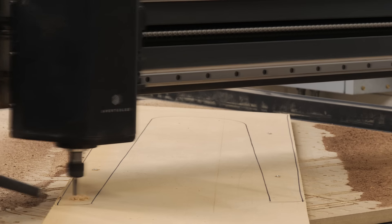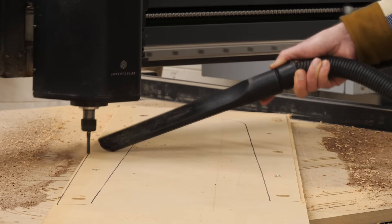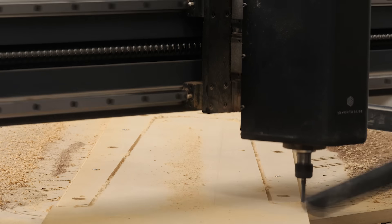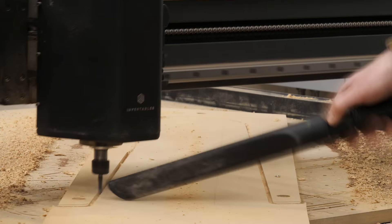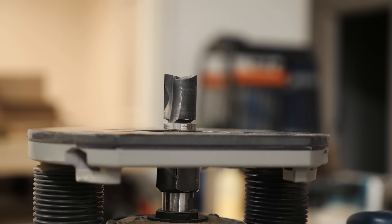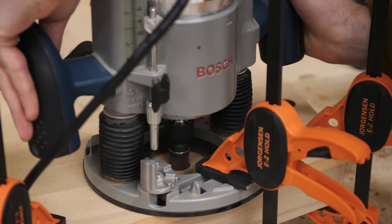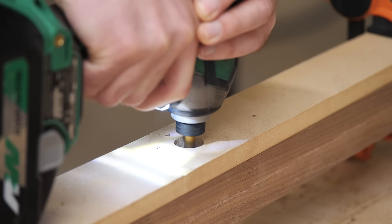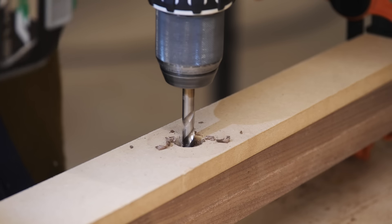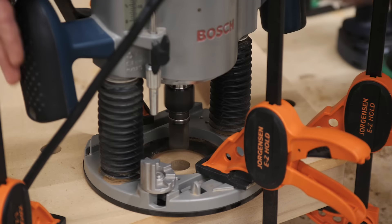Since I already had the SVG file set up, I cut another piece on the X-Carve with 7 little pilot holes carved in as well — basically a story stick. You could make this by creating a shape out of plywood and drilling the holes through, but it was already set up so I figured why not. The pattern bit already in the router cut perfectly sized mortises, but the blades on the tip don't extend to the center, so you can't just plunge down freely — the center bottoms out and leaves a ring shape. To combat that, I attached the story stick, drilled a pilot hole all the way through, enlarged it with a few more bits, then came back to cut the mortises with the router. It turned out to be not as hard as I feared, but definitely as laborious — maybe more.